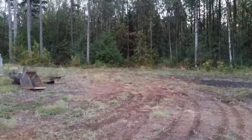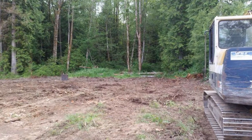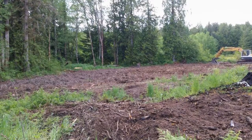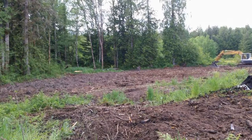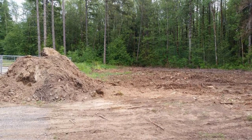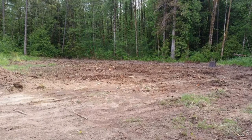The purpose of leaving the ground for a year was to allow it time to settle and actually harden up on its own, which it did really well. I did ride on it just a tiny bit, but it is a sandy loam so it's a little slippery. The following spring I had my contractor come back to do the final grade, and at that time I decided to take a couple more trees out and expand it by another 15 feet or so. He did this final grade with the slope so it sheds the water, and after the final grade we let it sit again for a while to let it finish hardening up.